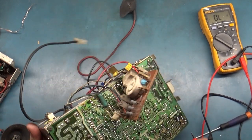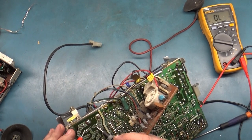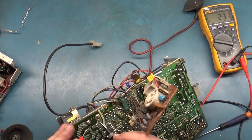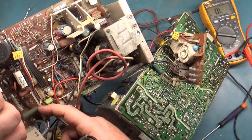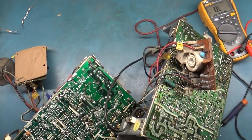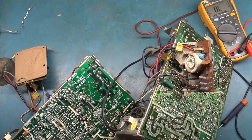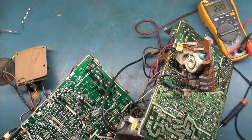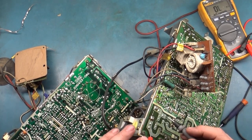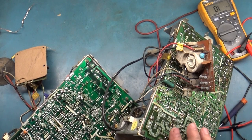I don't know. Let's check 501. I'm pretty sure we did. We're just checking to make sure it's not shorted. It is shorted. C501 is this green guy right here. What does it read on the working chassis? Same thing, you trickster. C501, 22, let's go to ohms. Just when you think you've got it figured out. 22 ohms exactly, C501, 22.6 ohms. So that's not the problem.